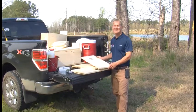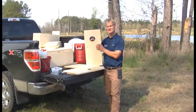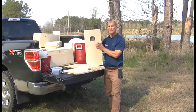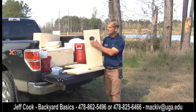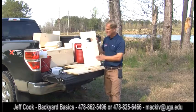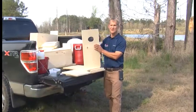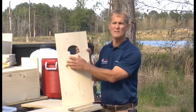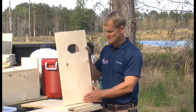The most important part of the wood duck box is a way for the wood ducks to get in. It's kind of an oval hole — the perfect shape of a duck. They're not perfectly round, definitely not square: three to four inches wide by three inches tall, oval shaped. You can cut it out easily with a jigsaw, then use some sort of sander or sandpaper to smooth the edges so nothing catches as they're entering and exiting. Smooth it on both the inside and outside.